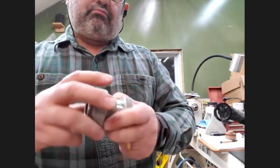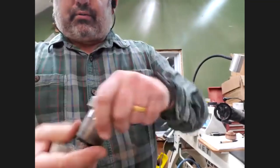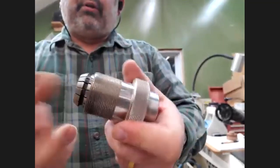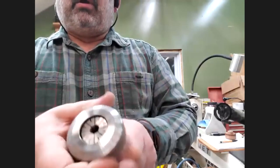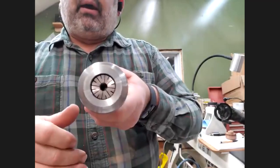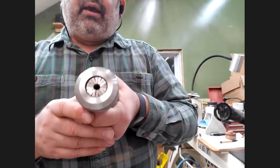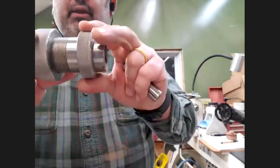The way this works is you put your chosen collet inside this holder, put the collar on it, and that compresses it around whatever you're holding. You need to turn your tenon accurately — that's the one downside for a collet. The upside is it holds things really, really securely and it doesn't mark them up.